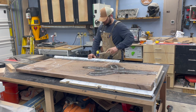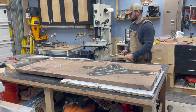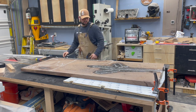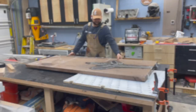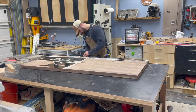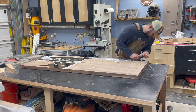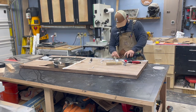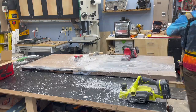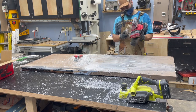The slab had been sitting for about three weeks curing in the mold while I worked on the base. It was finally time to demold it. The mold release spray made it come out super easily — that partial mold popped right off. You can see why I had to add so much extra material: those extra little dams I put in ended up saving me and preventing any major leaks. To clean up the excess epoxy I tried chiseling, aggressive sandpaper, a carbide tip scraper, and an electric plane.